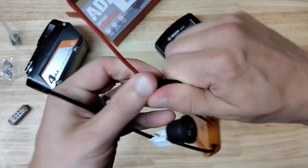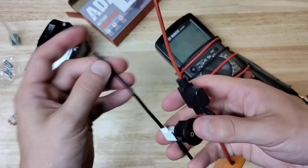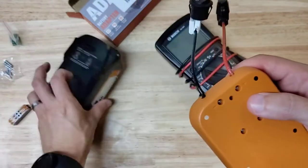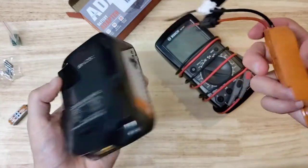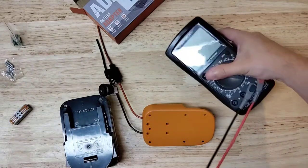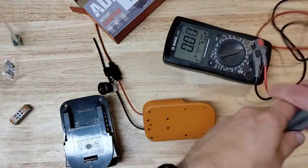I think there will be a fuse in there already — yep, so three fuses total, all 30 amp. You have a switch on and off. I have here a fully charged 4 amp hour battery from RIDGID, so we can try that out and do a quick test here with our multimeter. We're not going to hook this up to anything at the moment — just double check. 20 volts DC mode, that's about what we want.